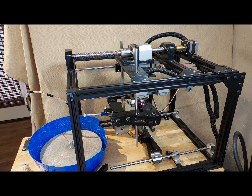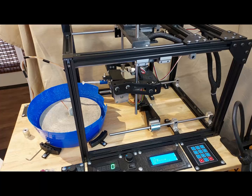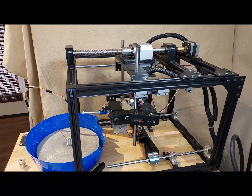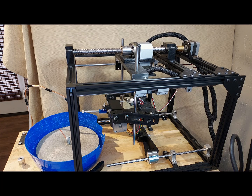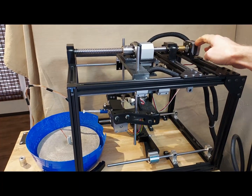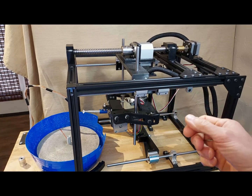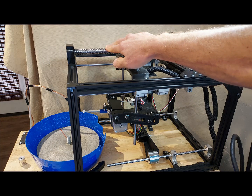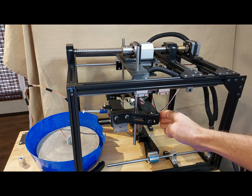The basics for running this machine are pretty simple. First, I switch on the power. Once the power comes on, the screen will light up and a pre-programmed message will display. In this case, it tells me it's ready — press 1 to start. One of the most important things about this machine is that because it runs on Arduino, as soon as it receives power, it's going to want to run whatever program was already installed on it. So I had to put in some sort of delay which allowed the user to tell the machine when to start. I put up a program that's going to run the stepper motor one revolution forward and one revolution backward, then the y-motor one revolution forward and one revolution backward. On this machine, you have 200 steps per revolution, and one full revolution on these screws is five millimeters. So we're going to see the motor travel five millimeters forward and five millimeters backward, then the whole platform travel five millimeters down and five millimeters up.